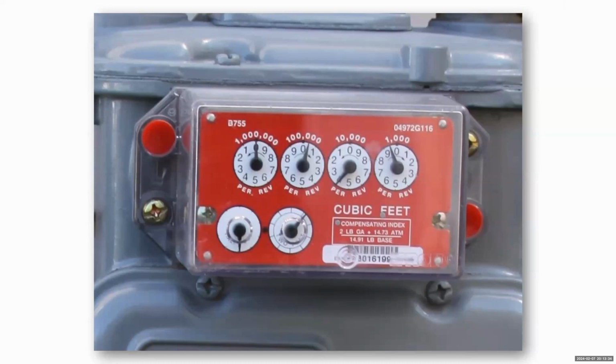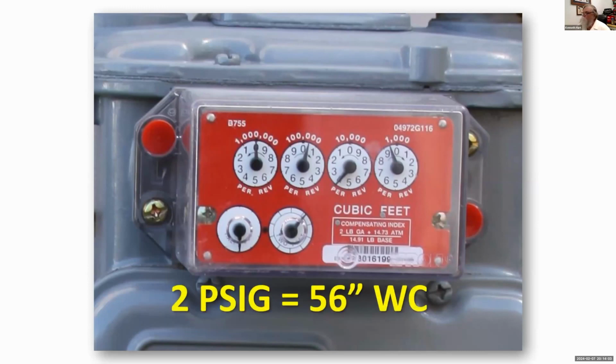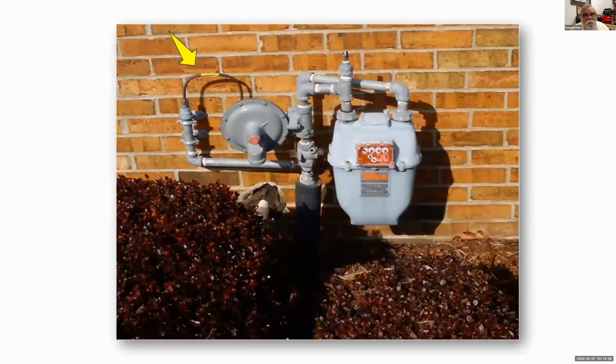And if you can use a smaller gas line, and in many cases it could be copper or it could be CSST, you can pipe the houses quicker. They can sell more gas, of course, if you're out there jamming these things. And things like gas logs are real easy to pop in instead of the old process of cutting and threading pipe, which just takes forever. So, anyway, the 2 pound system was developed to make it easier and, honestly, to sell more gas.